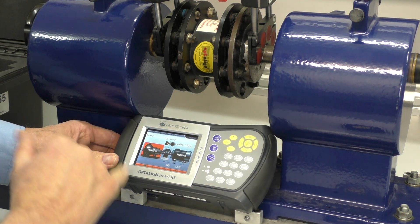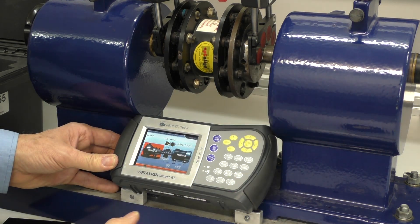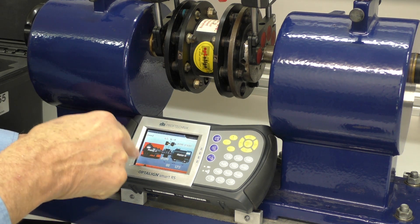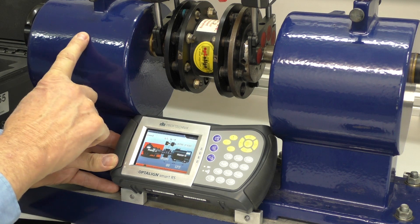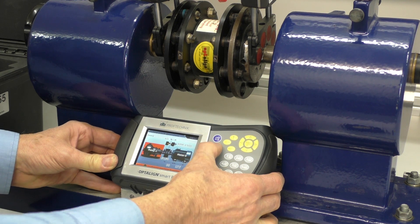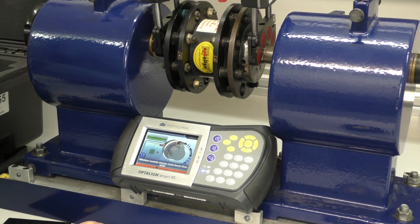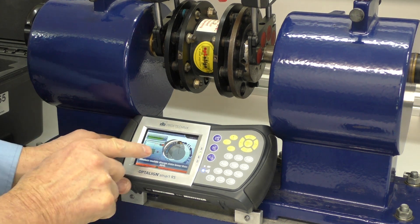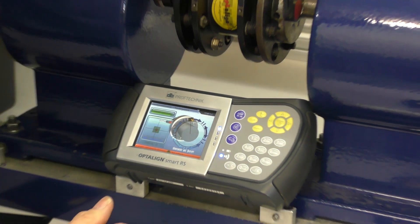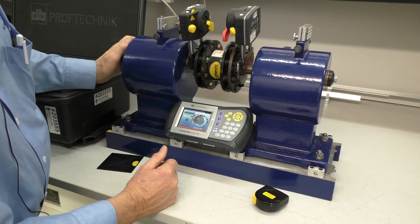Now it's asking for the engine speed — 1,500 RPM. Now it's asking whether we've got feet or what this motor is actually driving. In this instance I'm going to assume that there are no feet — for example in this case there's a pump, there's no feet on this second half here. So now we're all ready to go. We hit this measurement button. Now it's initializing, finding the two transducers. We can see this little dot — we've got to move the transducers so that we get it in line. Now that's nicely in line. We can adjust it up and down using the dial on the transducer. Now we're ready to take a measurement.